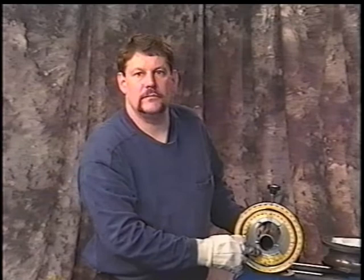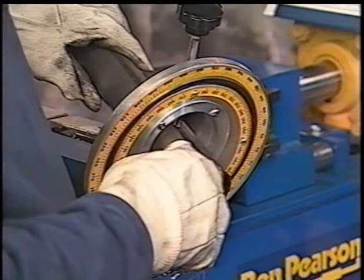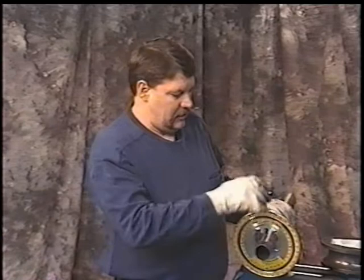The one other thing that we do, that we talk about, is we set this pointer on this seam. There's a reason for that. You may be bending and maybe bump the vise or bump a bench or bump a car or bump the hoist, something on that order. You may move this rotation dial. If you didn't have a reference point to go back, you'd have to start over. What this does is it allows you to bring that dial back to the center, and if you make that a rule of thumb, habit, you'll do it every time. You'll know what you can do to save your pipe if you ever bump it.